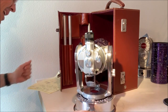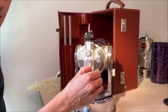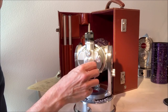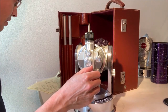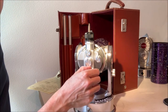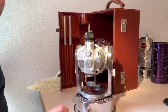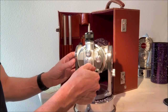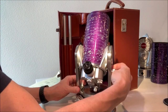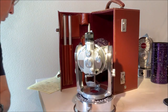You may be working the 10 turns forward beyond infinity where nothing can be in focus, or you may be over the full range of 45 or 50 turns total that lets you get very close up. By my estimation in typical scopes, you're about 12 turns back from the fully in position to get to infinite distance. A mere two turns more gets you as close as a hundred feet. A dozen more turns gets you to 20 feet or much closer. 20 more turns gets you from 20 to 10 feet. After close-up viewing, return that knob to a reasonable distant viewing position — don't just slew it into position because it'll strike, scrape, and damage the telescope.